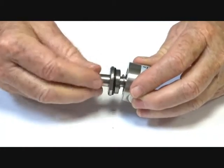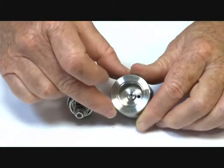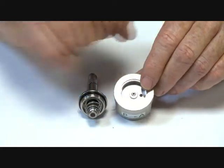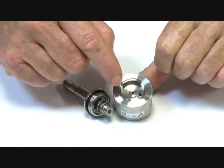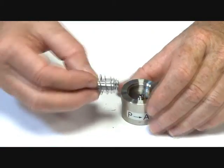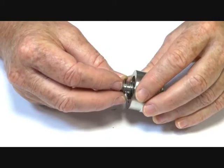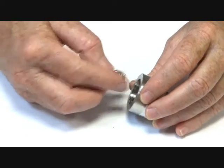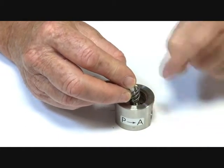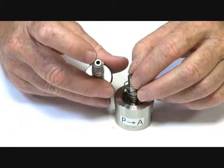I've already loosened this assembly off to show you how it operates. The liquid or media air comes in here, which is the inlet port, up through the center stem, sits underneath the jet here, and when the operator lifts it goes out down that hole and out. In a normal situation, this is the armature. The armature is sitting on the seat, held closed by the spring. Coil energized, the armature is pulled off open and the liquid goes down through here. When it's de-energized, the armature is on the seat and the downstream pressure is vented back up through the hole and back out through the center of this operated stem tube.